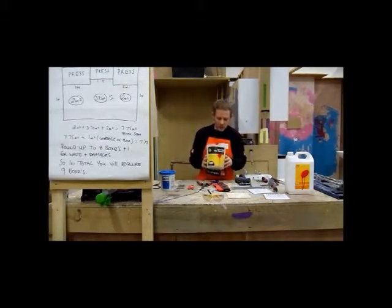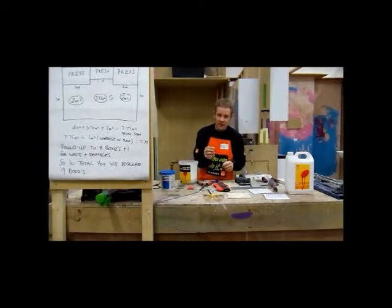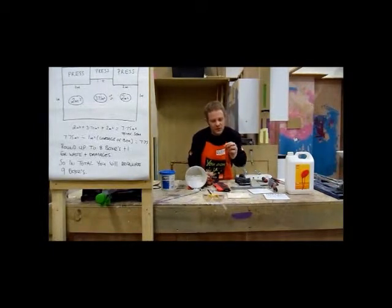Then we have our actual wall spacers — the tile spacers. These are 2mm thick. The reason for that is that on a wall it is generally technically pleasing to have 2mm joint lines, as opposed to the standard floor spacers. Another difference between these two types of spacers is that the actual floor spacer is bowed out. This is because when you come to do a tiled floor, you can actually leave those spacers in place and then just grout over them — the grout will sink in and cover the spacer. Whereas you would never actually leave your wall spacers in, so therefore they are soft and removable.